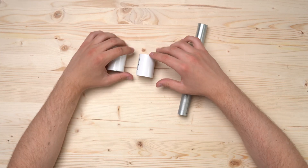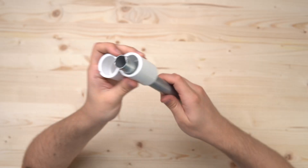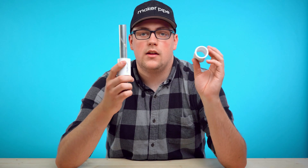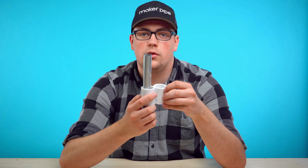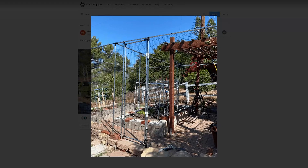This next hinge is from community member Marie, who used two off-the-shelf one-inch PVC couplers. She bolted them together and then secured a piece of conduit into one of the couplers. With one conduit piece secured and the other loose, when it sits onto the structure you have a hinge that swivels freely. Marie made a pretty big enclosure with a large gate, and it looks like it's holding up great — she's happy with the result.